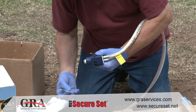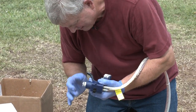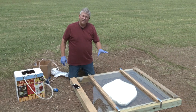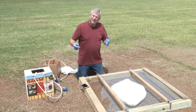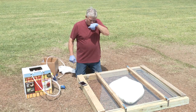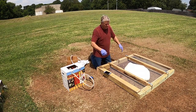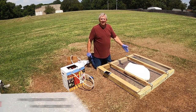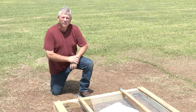We'll protect the gun. That's how you can access and fill a void under a garage floor or carport — basically when you have no access from the outside, you can still take care of known voids. If you had hammer-sounded the floor and knew there might be another void in a corner of your garage, you can move to another location and continue to fill it. That's how it's done.